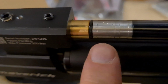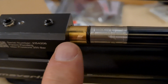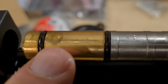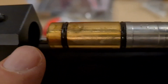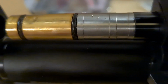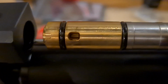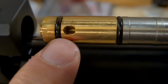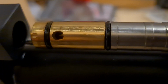And also, while I'm here, I'm going to rotate this round and see if I can just eyeball whether this barrel has a port for pellets and a port for slugs. That slight dark mark here tells me where the grub screws have been pressing on the barrel, and also even clearer here. So I know to keep those two at top dead center when I slide the barrel back into the breech, because I'm going to rotate it so I can see underneath to see if I can see the pellet or the slug inlet hole for the barrel. And behold, there is only one, and you can also see the slight keyway where the barrel keys in, so you can't have it misaligned. But that looks like it's only the one air port for the barrel, so it's not got a specific slug setup.